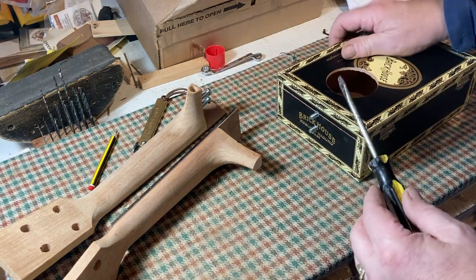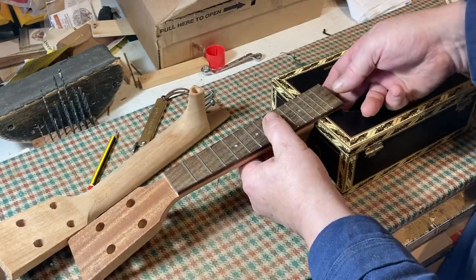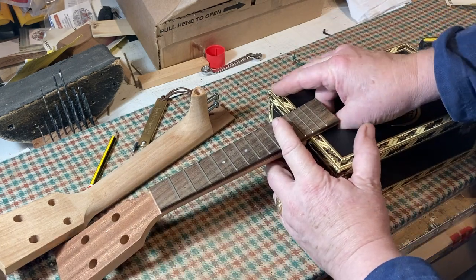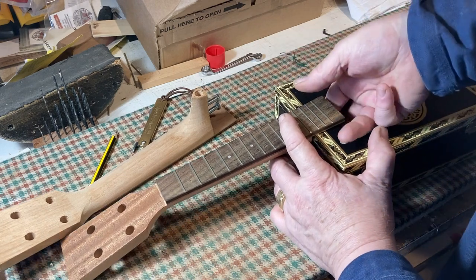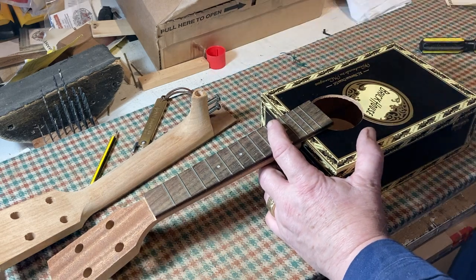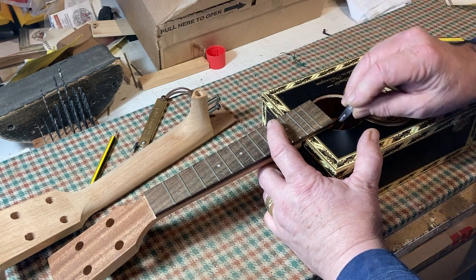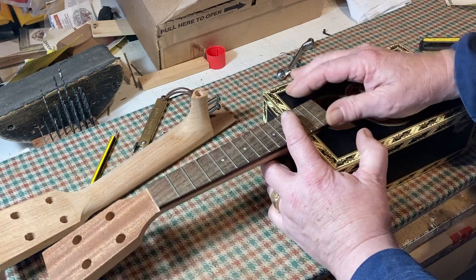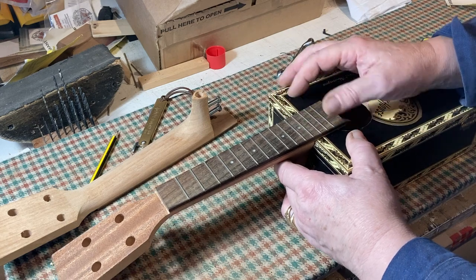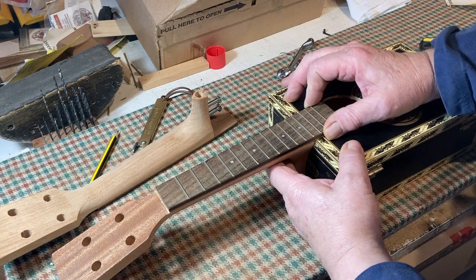All I need to do now — got a bolt and a washer there, bolt and a washer here. I have to close the top, obviously. Then all I need to do is align that, and I can get those going with my finger to get them to engage. Then I can put my spanner in there and tighten that up to get a nice, snug fit. It's a little bit fiddly, but you can see how that's achieved — you get a nice, strong fixing into that. You need a little heel block.